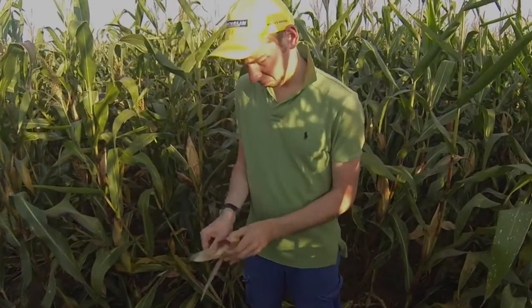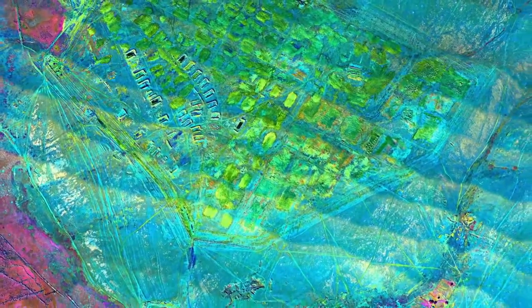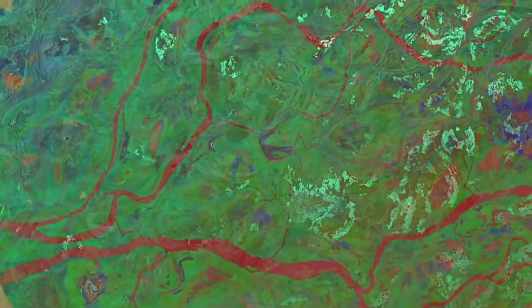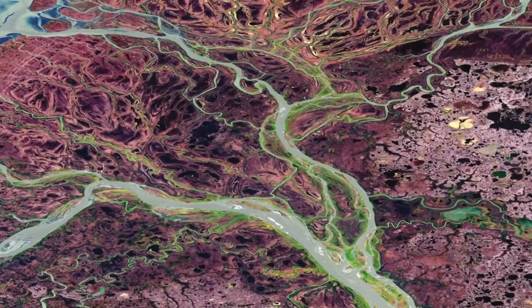We can actually derive information about the presence of different weeds inside the plots, which will allow the farmer to treat in a very precise and targeted way. The novel thing about our camera is that it is a snapshot camera. Traditional hyperspectral imaging cameras are scanning cameras, which means you need to fly over a field and scan it line by line. In our case, the process is dramatically simplified — each image is a complete two-dimensional image, requiring very little computational resources to stitch together into a large-scale hyperspectral ortho photo.